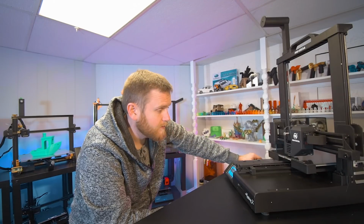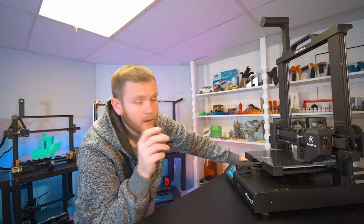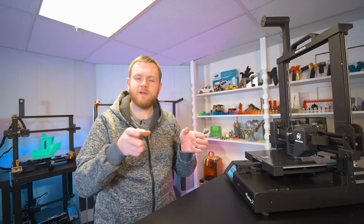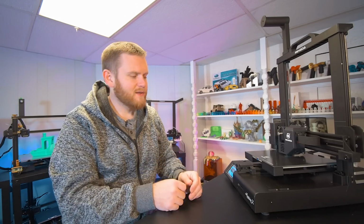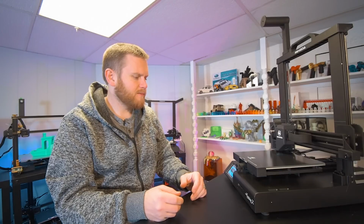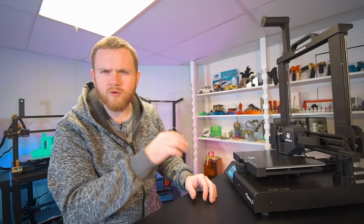Yeah, it looks like as soon as it makes some kind of contact with the bed, it stops. Looks like the bed rides on two 20 by 20 extrusions, but they're about three sets of 20-20 extrusions wide. So it would be like a 20-60 equivalent, but it's two 20-20s with a piece of plastic channel in the center. Once again, kind of like an injection molded plastic piece to hold everything together. A lot of smart moves here.